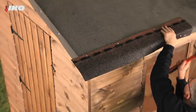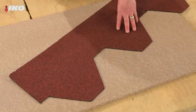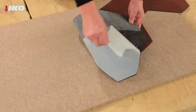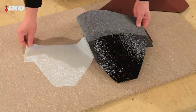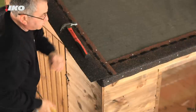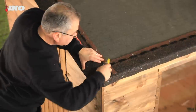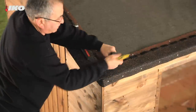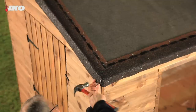If you are using hexagonal shingles, you will notice that there is a self-adhesive peel strip on the back. Leave this in place until just before you are ready to fix the shingle strip to the roof edge. At the corners of the roof, cut the roofing shingles to allow an overlap when folded around the corner and nail this in position.